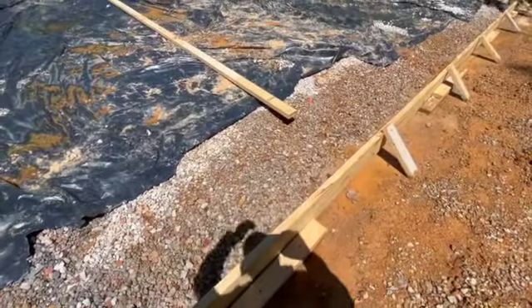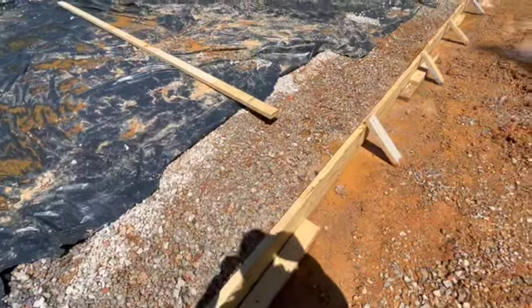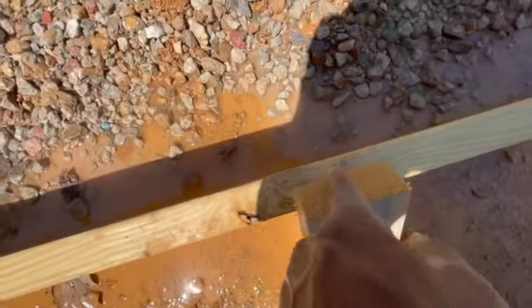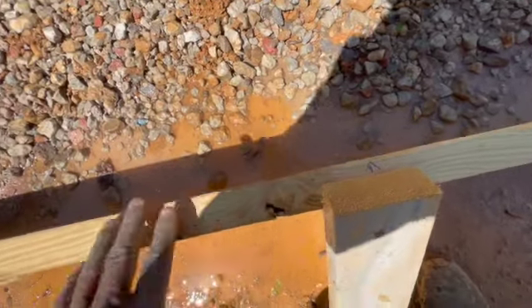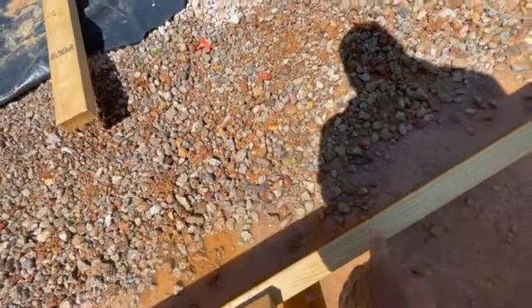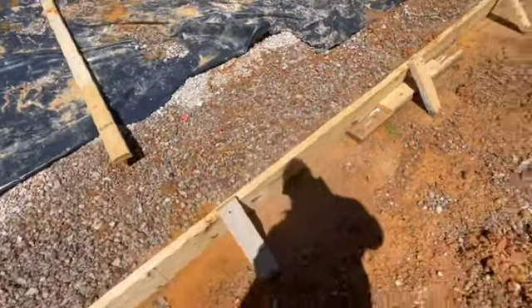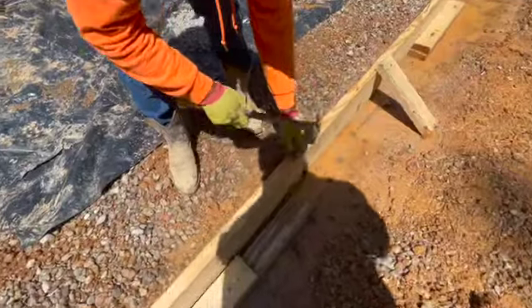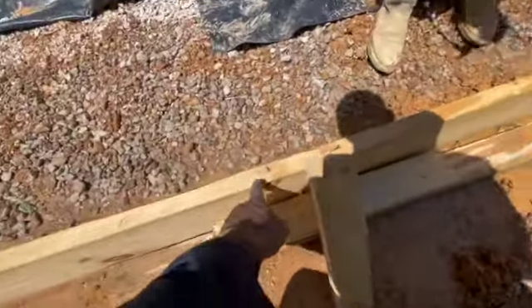The way they do it on the plans is a little different — they just give you the dimensions of the garage door. So I got to measure out five feet from that, which is right here. That means we don't need an anchor bolt in that little area, but we do need one within 12 inches of this area. That's the end of the door right there.